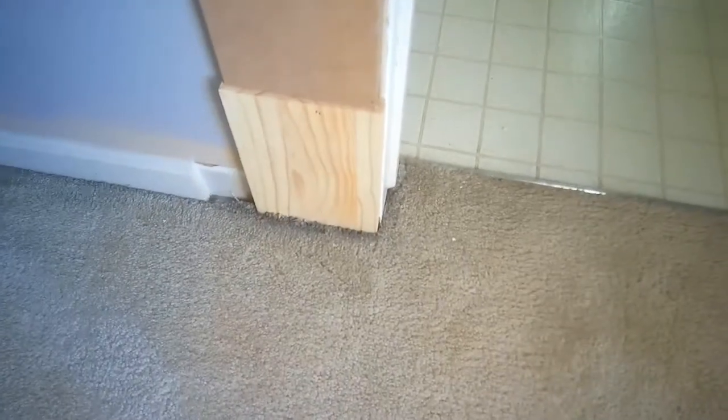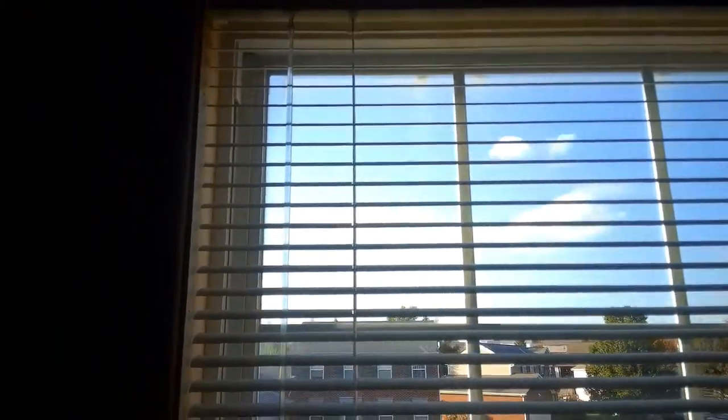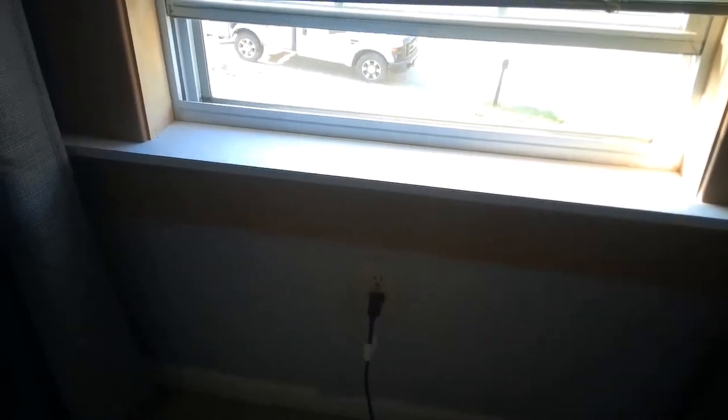Here's a header — it's just been primed. You can see the MDF legs, five and a quarter inches wide. The plinth block is made out of pine, five and a half inches wide, approximately nine and a half inches tall. The legs are usually around six feet long, and the headers are going to change with the size of the door. You can see one of the windows here — I just changed out the sill and added the stool there.